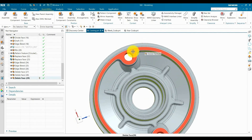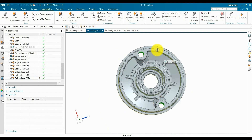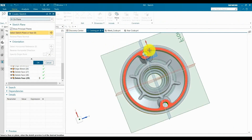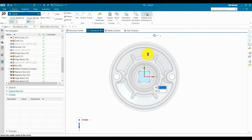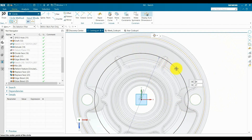We try to use the machining face as much as possible for ejector pin marks because it will be removed after machining. When we provide an ejector pin on an as-cast area, we provide the ejector pin mark in depth. When we provide an ejector pin on a machining area, we try to keep the ejector pin mark up. Sometimes the ejector pin position is defined by the customer; sometimes we propose the ejector pin position to the customer at the RFQ stage.